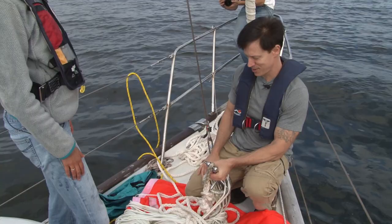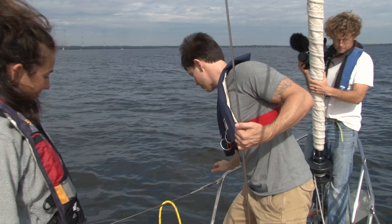And everybody out there, when we have the parachute sea anchor on board, that doesn't mean the helmsperson takes off on us. The weather's going to be sloppy, and it'll be very bumpy for us if we're trying to pack this up. So when we're finished packing and we put the parachute away and the rope, then we can signal the helmsperson to start moving forward, because it's very difficult to pack the stuff when the boat's just slamming all over the place. And I think that's good. You did well. We maintained control of all the ropes. When everything went under the boat, you signal the helmsperson to move away from the equipment.